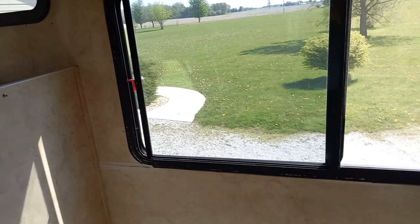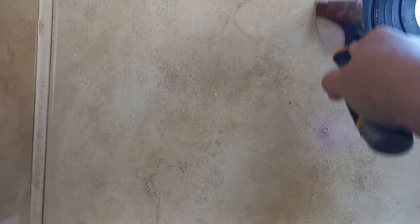Remember that your prep is actually what makes your paint job look good. So if you don't prep it good and have a nice surface, your paint job is not going to look great. So we have this spackling — this is the stuff that's pink and goes to white when it's dry. I'm just going to take a dab of that, put it in the hole, and then scrape it so it's flat. That's the most important thing because if you leave a hump, it's just going to be more to sand. So many holes — oh, that's going to take more.